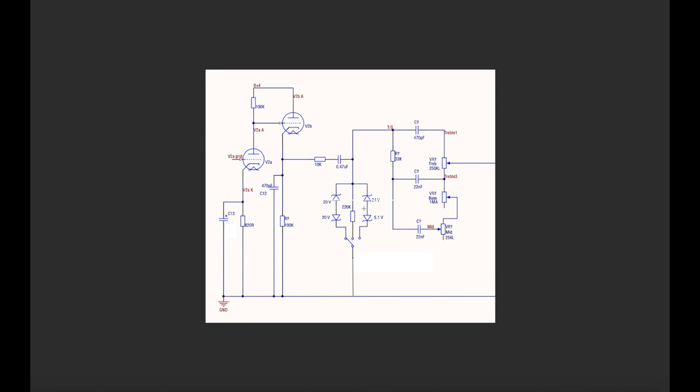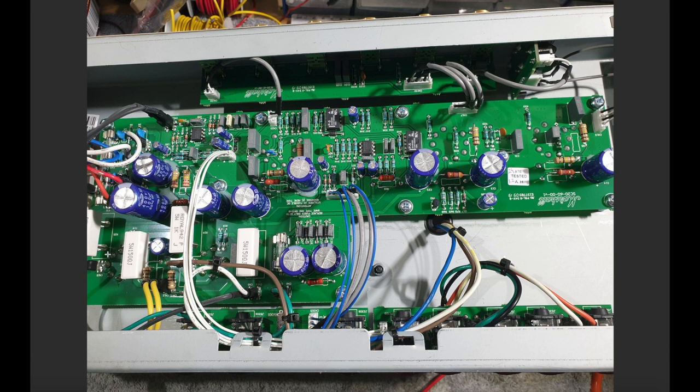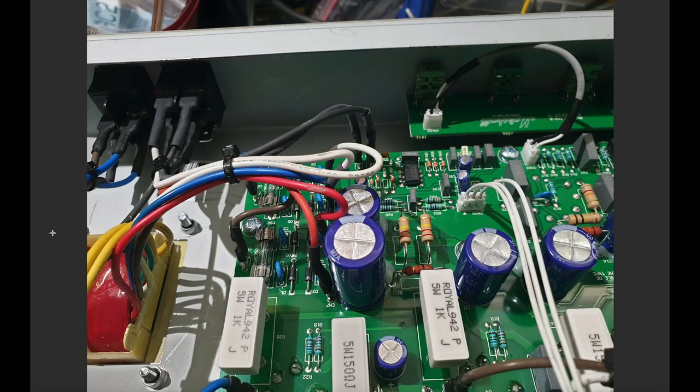So what we'll do now is I'll step through a bunch of pictures, so kind of before, during, and after. Hopefully the pictures give an idea of how to implement these mods. It's one thing to look at the schematic, it's another thing entirely to shoehorn these things into an existing amp. This is the Studio Classic 20, out of its head shell. So let's go. This is the stock PCB without any changes. This is how the amp is when you first pull it out of the head shell, unmolested, no changes. Interestingly, this is a cathode bias EL34 amp.